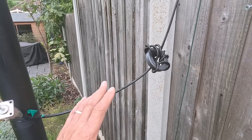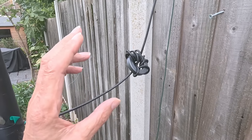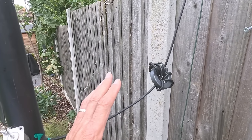The other isolator at the other end makes sure that any RF from the coax is isolated — doesn't interfere with the transceiver, doesn't interfere with the SWR readings. I don't get first prize for construction. I'll probably weatherproof that because I think I'll leave that antenna up for the winter — maybe I'll change my mind, that's the way I work. Anyway, let me now show you how the 7300 copes with the half-size G5RV.